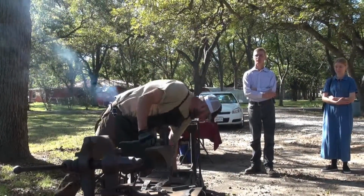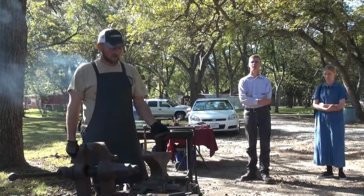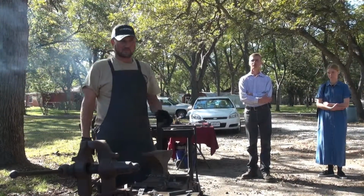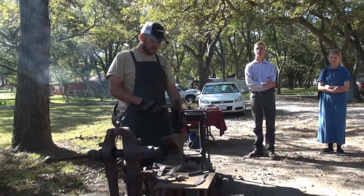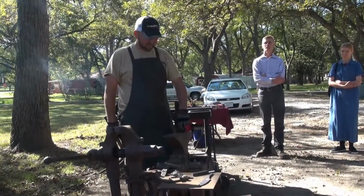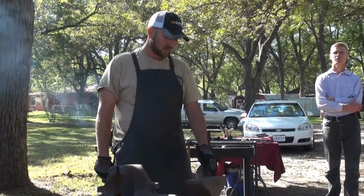This shelf right here is called your cutting table. Like I said, it's only about 40 Rockwell hardness, and these are like 50, 55 usually. So if I got to do any cutting, real fine cuts, I can do it on here, and you can see a bunch of where you go through it and it doesn't break your chisel. So that's just called your cutting shelf.